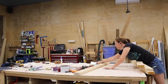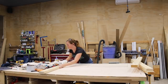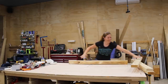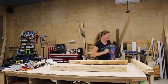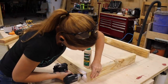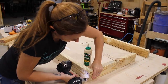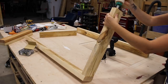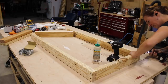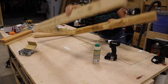I cleared a workspace on my plywood workbench, then positioned the four pieces that make up the body and started attaching things. Even though this might be stored inside a shed, this is an outdoor project, so I'm going with waterproof wood glue on all of my joints. After applying some to the ends, I first pre-drilled to prevent splitting, then drove in two screws per side, repeating on both sides.